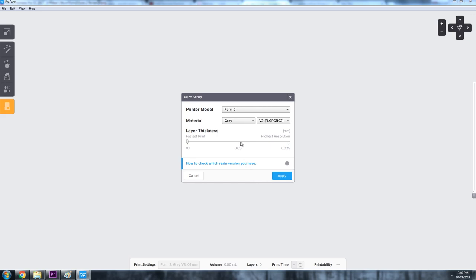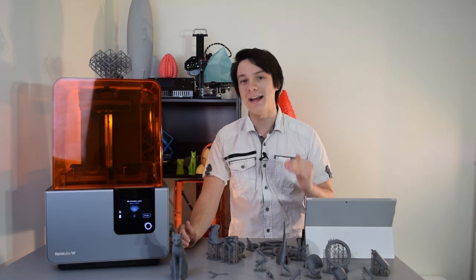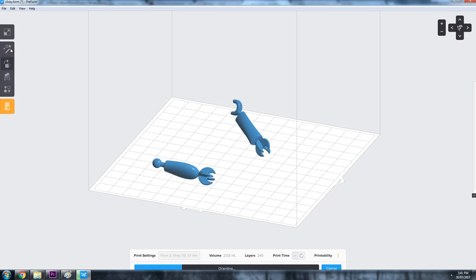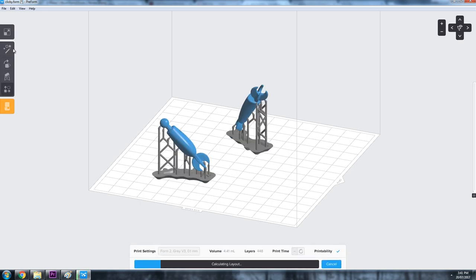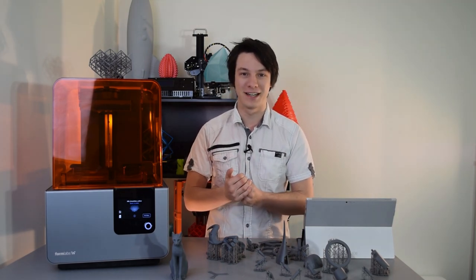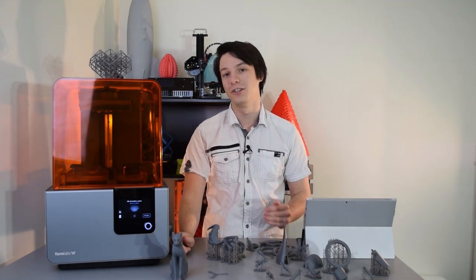Model makers, take note. Formlabs provide their own software called PreForm, and I have to say, it's only slightly short of pure magic when it comes to preparing files for this 3D printer. It prepares support material for you and the correct print orientation, it can do it all in one click, and it can even give you a print estimate and send it all over Wi-Fi to the 3D printer. You can do manual supports if you wish, and yeah, this software is pretty darn awesome. You can interface the machine with Wi-Fi or over USB, and the files send over really fast. I use this on Wi-Fi constantly, and I haven't had a single issue with the system during my testing.